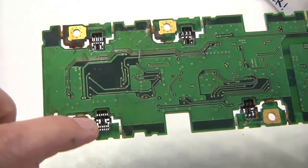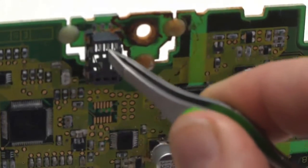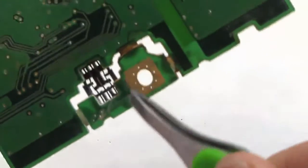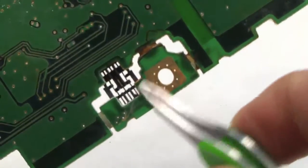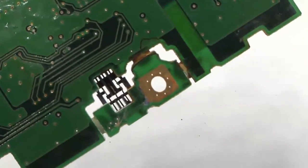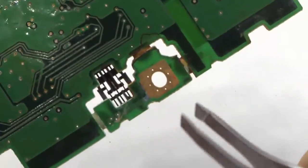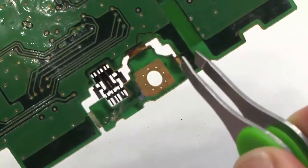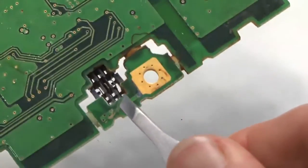You can also see that this pad where the screw goes through is completely isolated from the rest of the board. It's a separate piece held on by little dabs of something like silicone. And it's connected to the rest of the board by this thing — if you look really close, it's a little tiny resistive heater element. It looks like the way this board works for cell balancing is that resistor creates a little bit of heat. When the pack is charged in series, the microprocessor can say this cell is getting full and shunts off a little bit of power through heat. This is an air-cooled battery pack, so it has a fan and air that runs over the whole thing to cool that. Although with the corrosion, cleaning that up is challenging because it's just these little bare wires — really rusty.